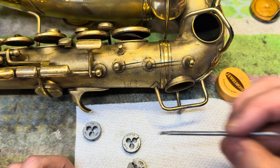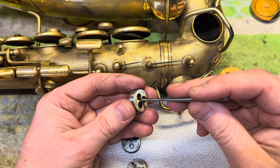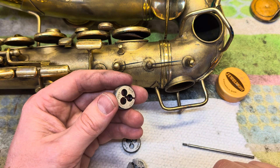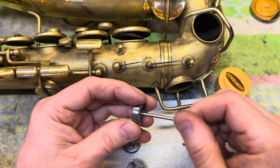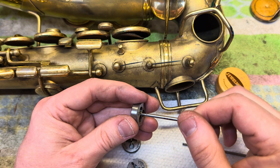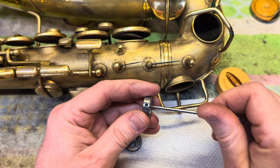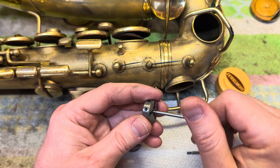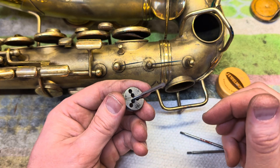Another test: here's the original screw. If you try to put it into a 3-48 UNC, it actually won't go — it goes in like a thread and then stops; the geometry doesn't match. A UNC screw will go into the UNC post no problem, nice and tight. But the NC that I made also won't go into the UNC post. And here's the 3-48 NC post, which takes the original screw snug without removing metal. The UNC slides in pretty loose, but the one I just made — snug without removing any metal.